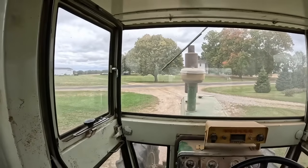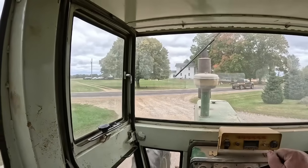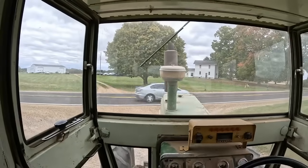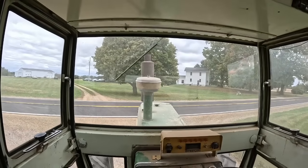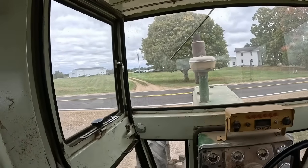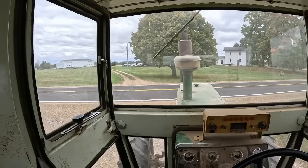The grain is dry, but boy, they were just fighting their way through the combine. I was creeping along just to run what I did run, and even then the rotor overload light was flashing more often than I like. So I thought, well, I've got ground ready to plant wheat on. Why beat up the combine?